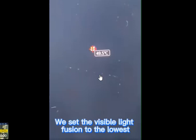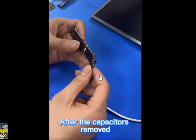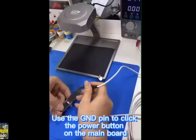From there you can now start the diagnostic method. Since this is a component that is leaky, you can just remove that component, or you can simply replace it if that component is very important on the motherboard. As you can see, from 200 milliamps it is now gone and the board can now boot. Check the link below if you are interested in this gadget.